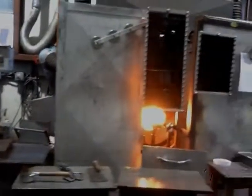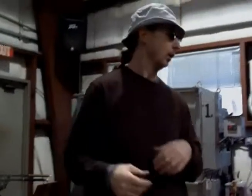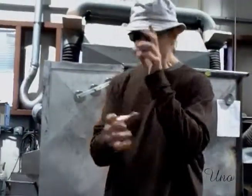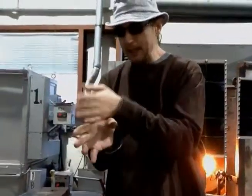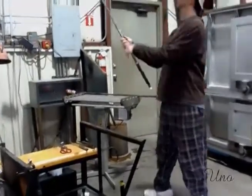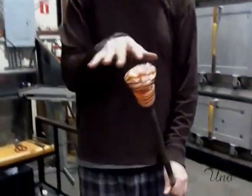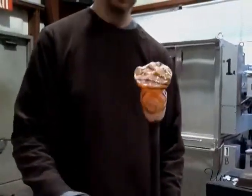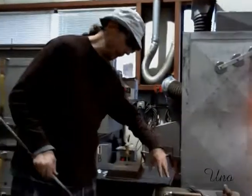We would take glass at 2,000. So what we're going to do is build up clear glass on a pipe, and then color with white glass. Then we're going to divide that clear glass up into 4 quadrants, and twist it very tightly like a barber pole. When we pull the barber pole in half, we get the horizontal striations, and that will make it appear like a painted desert. Once we heat it up, we'll drop it into this mold to create the geography.